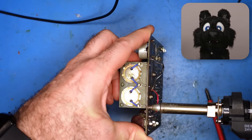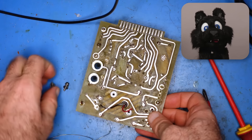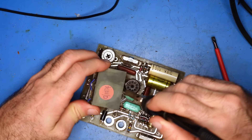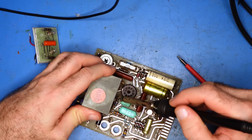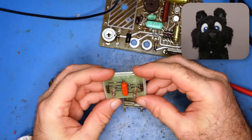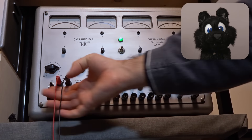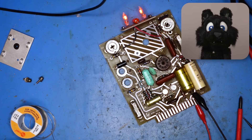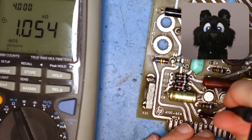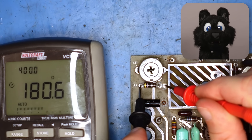Mark mentioned that the chopper assembly — the aluminium block on top — is questionable. Since it is the most central component to this design, I carefully desolder it and check the neon tubes. It looks okay visually. Let's connect them up to see if they light up evenly. Looks plausible. There's a slight flicker to them, but they both seem to be the same brightness. Up next, I check the components on the board. I'm focusing on resistors and capacitors for now. If the transistors are off it'll show up later, but if any of the support circuitry is broken it might kill the active components.